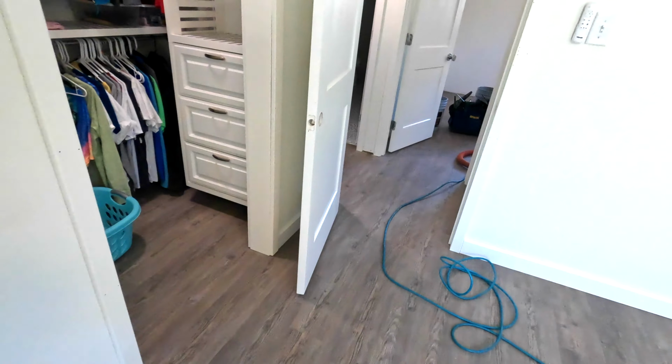In this video, you saw me measure this room, go out to the miter saw with the measurements, make all the cuts, then come back in and spread it and install it. And you can see these inside corners, how tight they are. I mean, there's no caulk, no filler. It will be caulked. I'll caulk the top edge for the paint so there won't be that line right along here. But look at the miter.